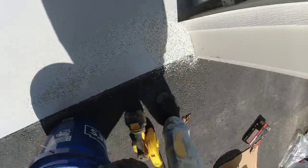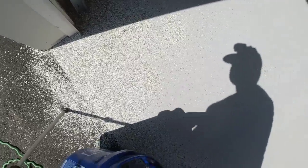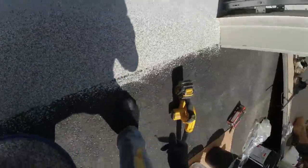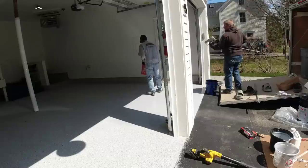The key to doing these floors is knowing the pot life of the product you're using. Pot life is how much time you have to work with the product — how much time you have in the bucket. With most good epoxies and polyaspartics, you don't have much time to leave it in the bucket as it will start curing up. You want to get it out and rolled out pretty quick, and then you have a little more time to work with it once it's rolled out.